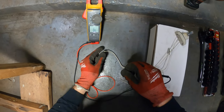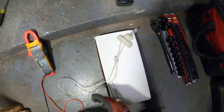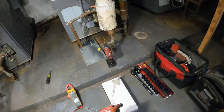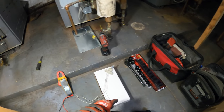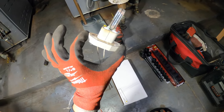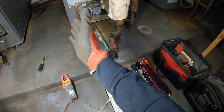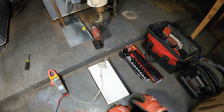I'm gonna check resistance on this — it should be between 50 to 80 ohms. We have 112 ohms, so we're definitely out of range. You can just see it has horrible discoloration. The water is off because the header is there, so I didn't have time to test amperage, but just by looking at it and with that resistance reading I already know it wasn't doing its job. Always read the manual for your specific boiler as you'll get different readings for different hot surface igniters. You want the 50 to 80 ohms more at a room temperature state.